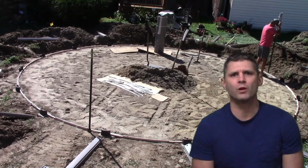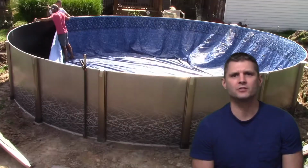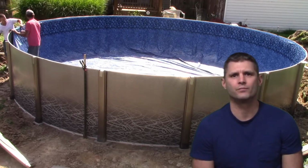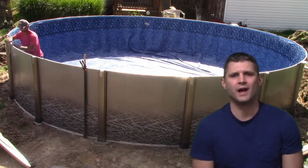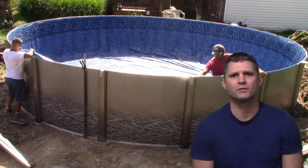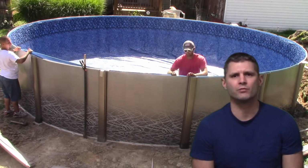If it is windy while installing the liner, also be cautious. By attaching the stabilizer bars and top plates as you install the liner, you provide more stability to the pool. This advice is for windy conditions and is contrary to the step videos, as it is recommended you install the pool without much wind.